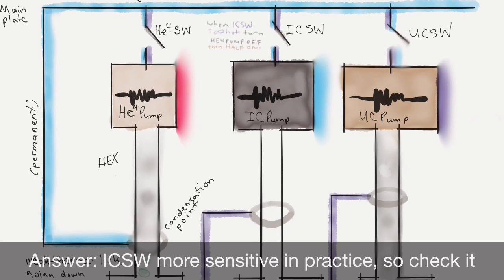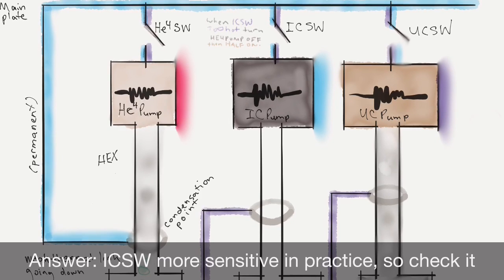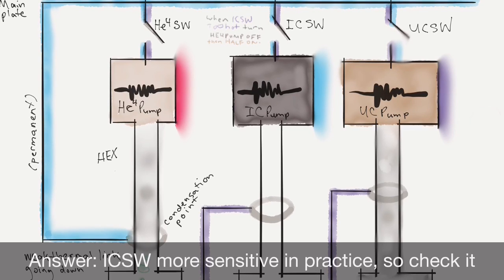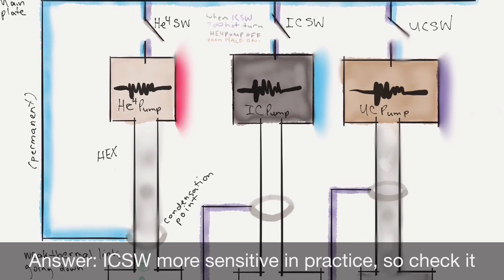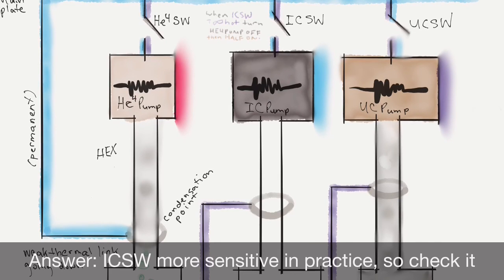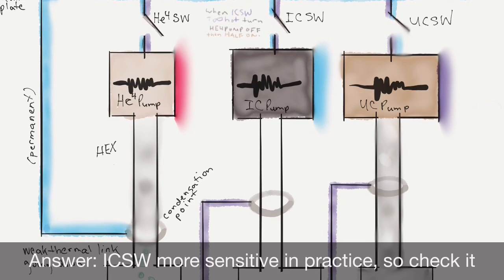But in any case, in the code, they check if the IC switch gets too hot, and if it does, they turn off the helium-4 pump for a little bit, and then turn it back on, but not to as high of a level. Of course, still high enough to push out helium-4 gas from that activated charcoal, but not as hot as it was initially. Okay, so we have some condensation of helium-4, which is exciting.